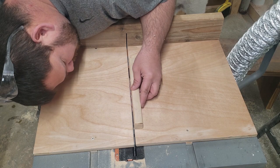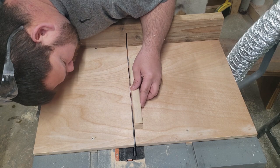To make this gap in the center piece, I got out my cross-cut sled from my table saw. I set the height of the blade for the depth of the cut, which I wanted to be a half inch.